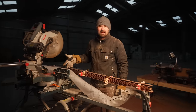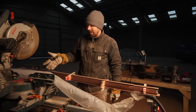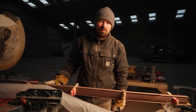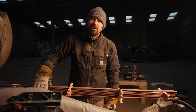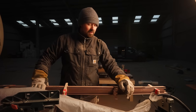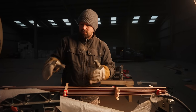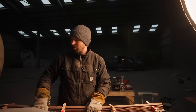And this is basically just one of those vacuum pack food bags that you pick up from Amazon, super cheap. And it's literally a 20 euro, 25 pound or something, I don't know. Super cheap wallpaper steamer from Amazon that we're using. So really, really simple. So the idea of these is we get the steam in between the wood. We'll steam it in here for about 15, 20 minutes and then see if we can bend it around the former.